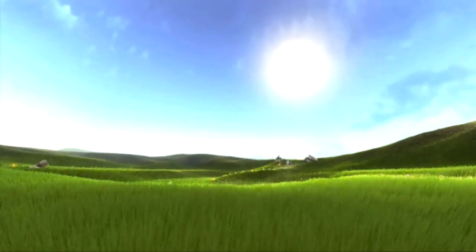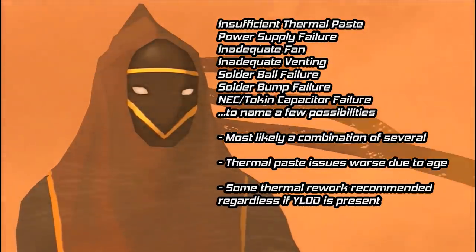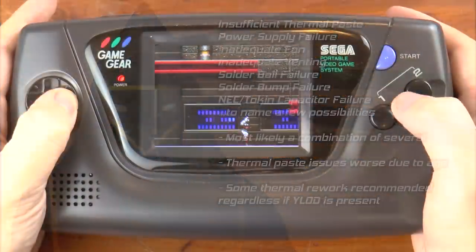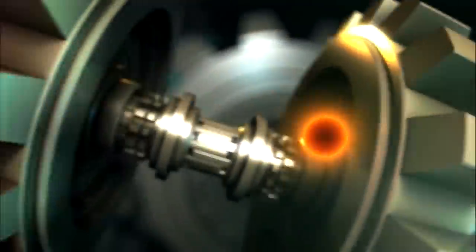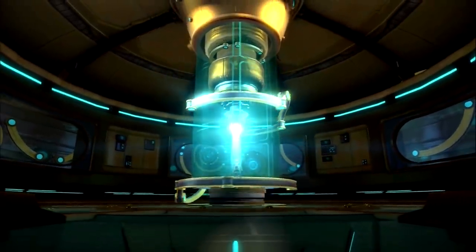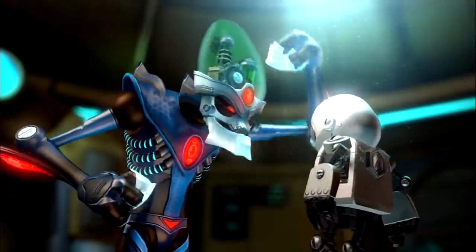So what is wrong with your yellow-lit PS3? The most appropriate answer is: I don't know. You can either assume or you can diagnose — assuming is easier. There are easy fixes that don't require diagnosing a problem; it is a fair assumption that the original capacitors in your Sega Game Gear have failed and need to be replaced. But the point of this video is to state that very little research has been done to facilitate an assumption that the solder balls on the PS3 are the primary reason for a Yellow Light of Death situation. I want to make it clear that I'm not saying a reball isn't a potential fix — my point is that it isn't THE solution, and that we as a community should adopt less of a tunnel vision approach when it comes to diagnosing and repairing consoles.